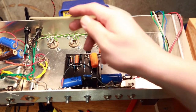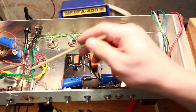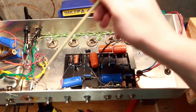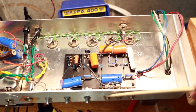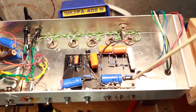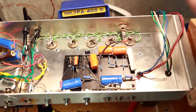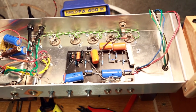We're going to get more done tomorrow, but I literally have everything else in place. I've got the power wire coming in grounded, I've got this grounding bus also grounded at that same post, and I have all of the grounding points coming to this point. The input jacks are grounded here as well. I still need to tie this ground line from here over to this guy, and also ground this section over to here too.